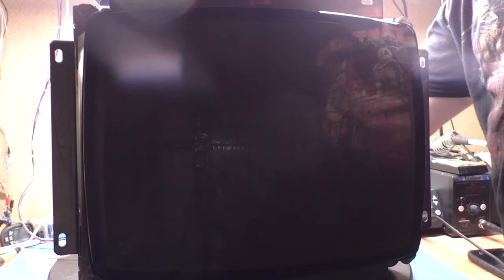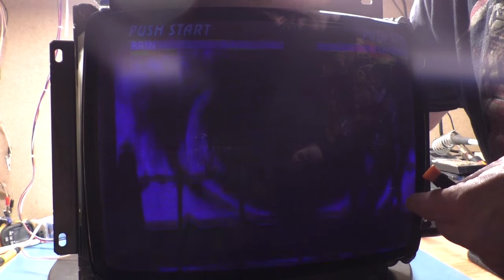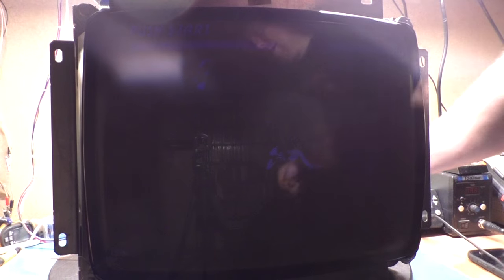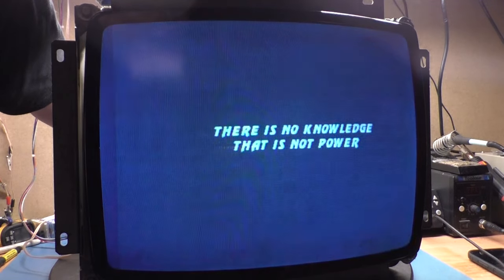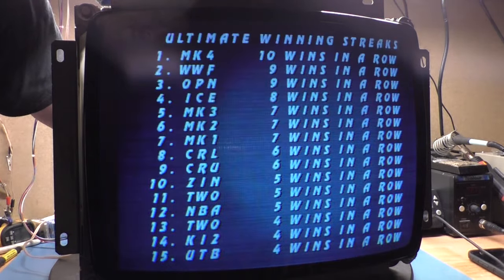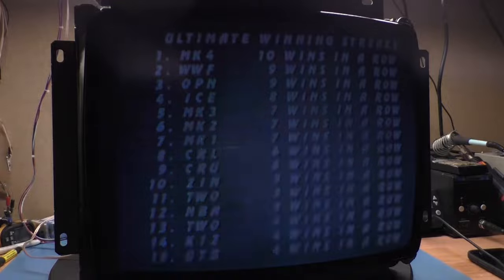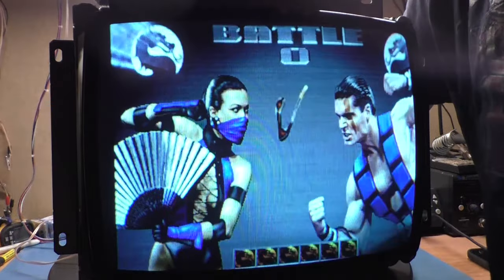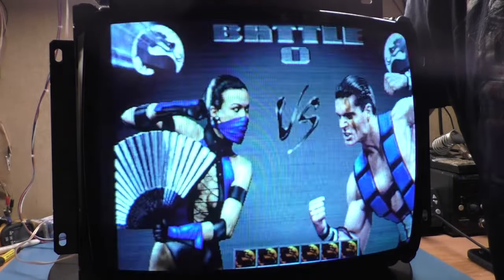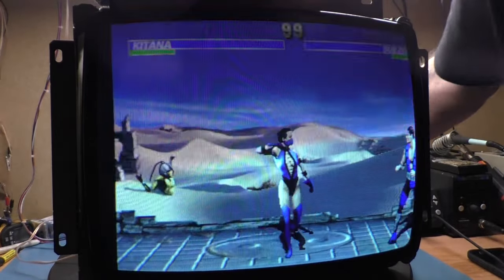That's weird. But, okay. Screen pot up until we get the raster lines. Back down until they go away, which will be there. Now let's turn up our brightness till the background is no longer black. Right there, back down till it just is. We're going to go right there with it. We'll turn up our contrast. Now let's hit our focus. Right about there is good.